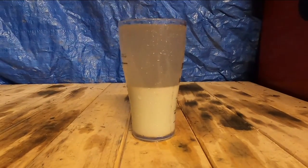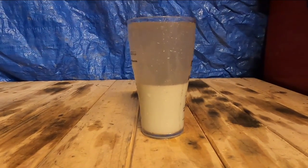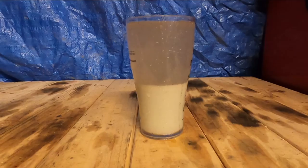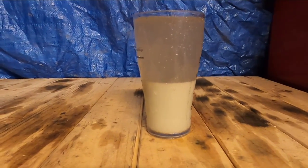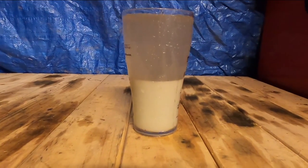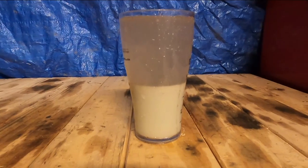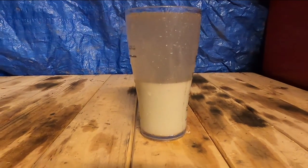Right, and you'll see that's a bit under 50-50, and that's the ratio I've been getting the best results with. Now, that doesn't mean that it's 50% glass bead and 50% water in the reservoir. I think through the stirring action of the agitating jet, it concentrates all the glass bead around the center where the pump pickup is. So realistically, there's probably only about 2 or 3 kilo of glass bead in there, and the rest is water.